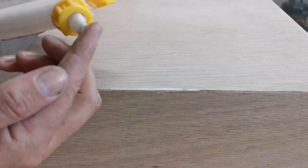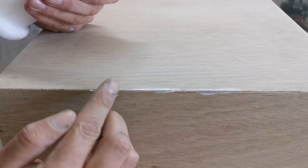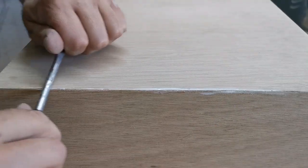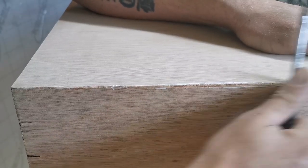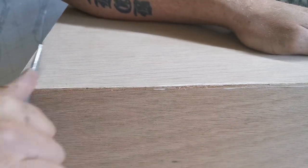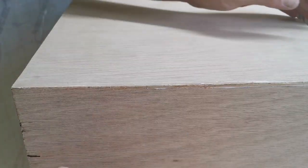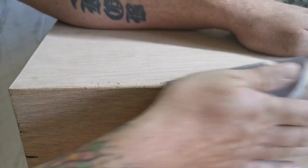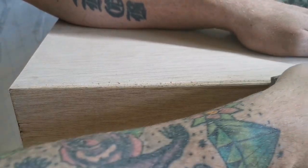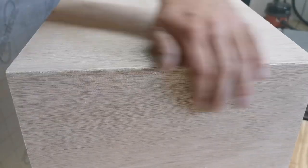Not too much at all, because I don't want it to affect the stain when I apply that later. Get the screwdriver and just roll it over the edge on both sides to try and close that gap up. Then get some 120-grit sandpaper, rub that down until all the glue residue is gone, and that should have filled any last remaining little gaps. And there you are — good mitre.